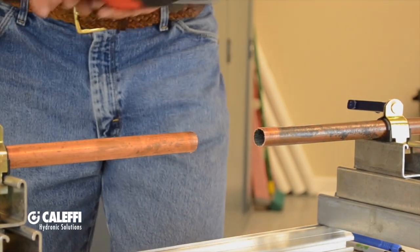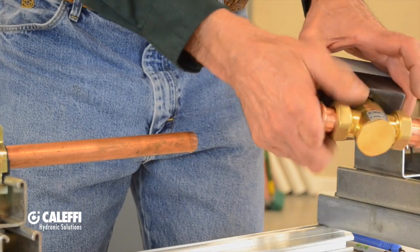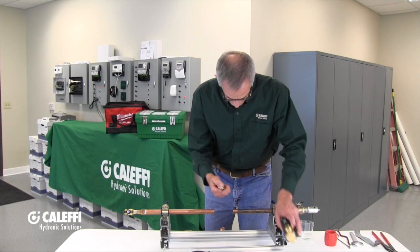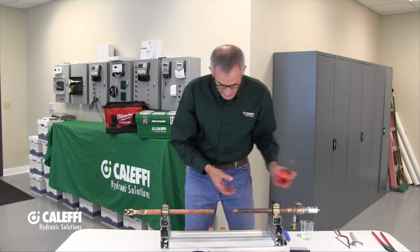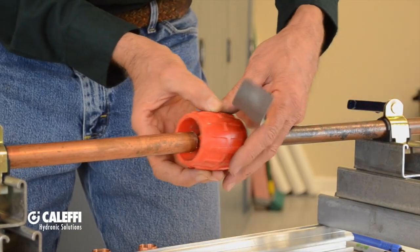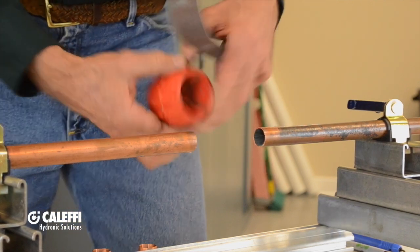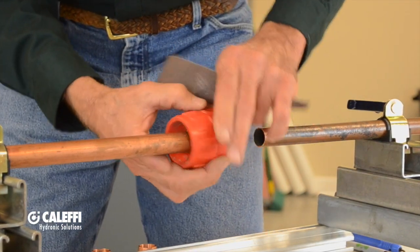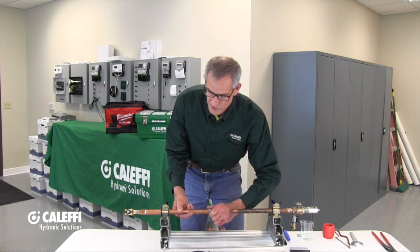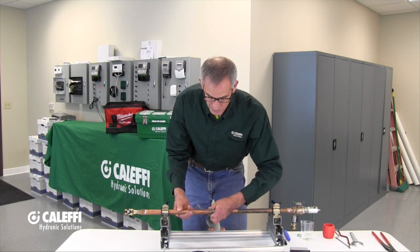You're going to scrap the brass pile. Now what I want to do is prep these ends so I don't rip the o-ring when I put these little tail pieces on. I've got the tail pieces ready in place here. There are a couple of tools you get with this — a reamer that'll do the inside to get the burr from the inside, on both ends. It's also got an external reamer that you can go around the outside to get that sharp edge where you cut it off reamed off. I also like to take a piece of scratch cloth, like a number 120 scratch cloth. I like to go around that because I can feel if there's any little bumps, ridges, solder balls, or anything left on that pipe, and then I can fine tune the edge. Do this carefully — some gloves wouldn't be a bad idea.